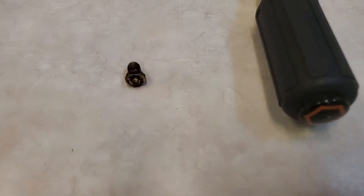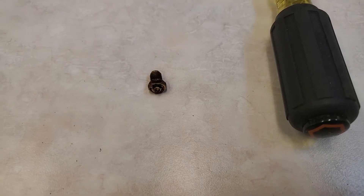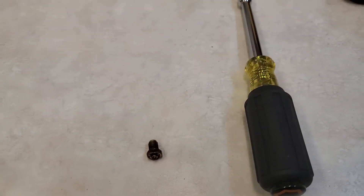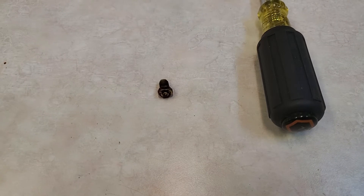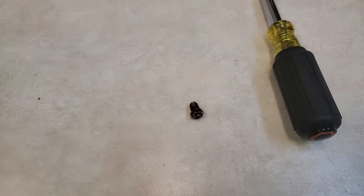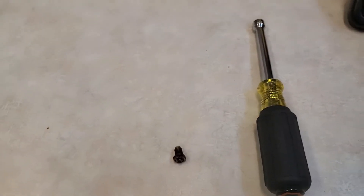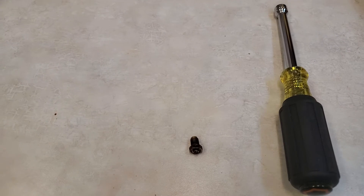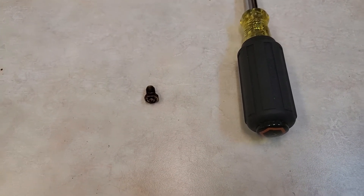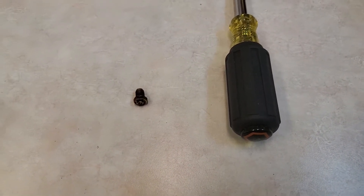I got the original nozzle pulled out and put the replacement nozzle in. Taking very careful measurements, I discovered that the length of the nozzles is about three thousandths different, measured from the shoulder where the filament goes into its collar and the printhead to the nozzle tip. The original equipment was 3.253 inches and the new one is 3.250 — a difference of three thousandths of an inch, which is about 0.0762 millimeters.